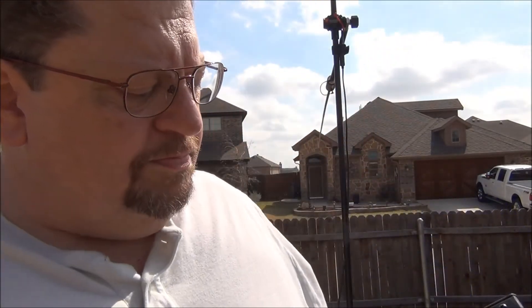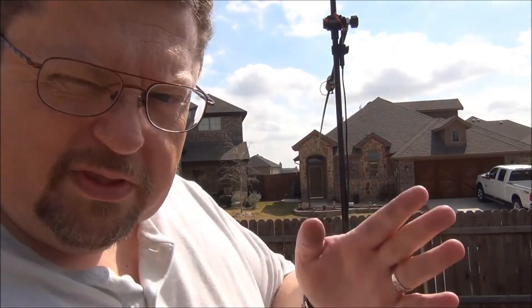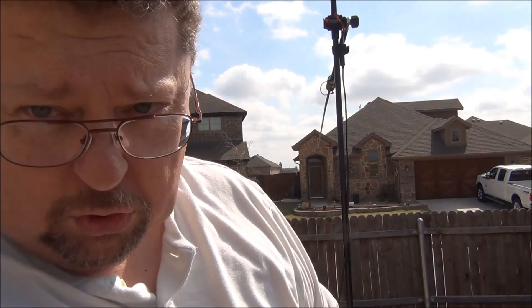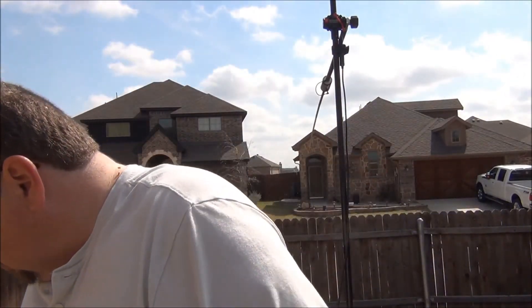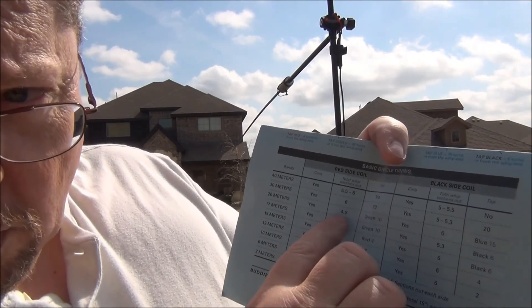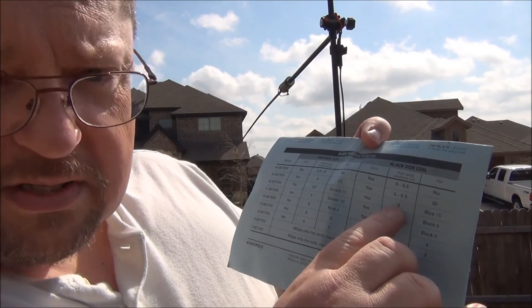One last follow-up: the one thing we didn't try before was changing the angle of the ground. I did some experimenting with that, moving it up and down, and I was actually able to get at the target frequency about 55 ohms with an SWR of 1.2. So the final configuration — looking at the chart here — on 20 meters they have you at 4.5, but I'm actually at 4.25, so I'm a little shorter. And the other side is at 6 on the chart, but I'm at 5.25. That's it for now, thanks for watching.